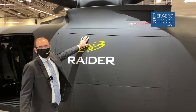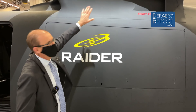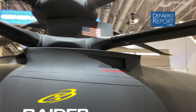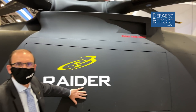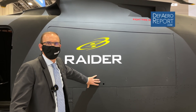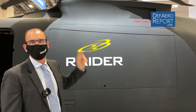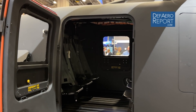In here is the transmission. There's nothing magical about X2 technology. The lower rotor is very much like any other lower rotor — you have three hydraulic servos pushing on a swash plate and making those inputs to the flight controls. You have three more hydraulic servos pushing on a swash plate under the main gearbox, with control rods that go through a standpipe in the gearbox to the upper rotor. But to the pilot, it's all fly-by-wire. You push forward on the stick, the nose tilts down, and you're able to control it just like any other aircraft.